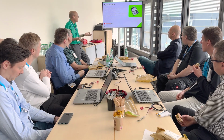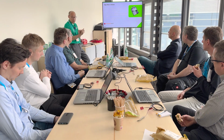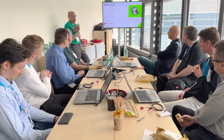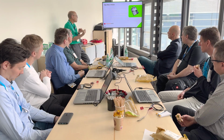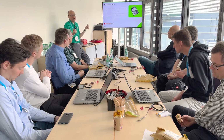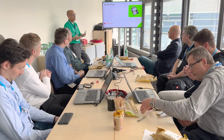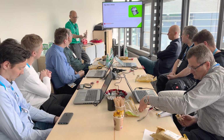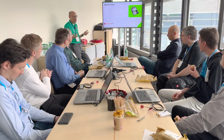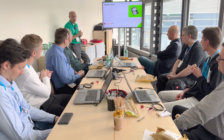So we talked about cellular and Bluetooth, but there's also two UARTs, so you can make two different serial connections. SPI, I2C, which we'll be using today with the sensors, and which really requires that MicroPython programming environment. You can't just connect to I2C and have it work. You have to actually interpret things and run libraries, and we can do all that. We'll be doing that today. And then GPIO, so digital I/O, and ADC, PWM, so analog I/O as well, are directly available.